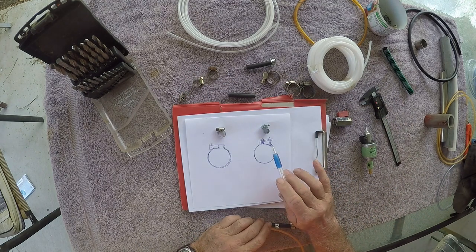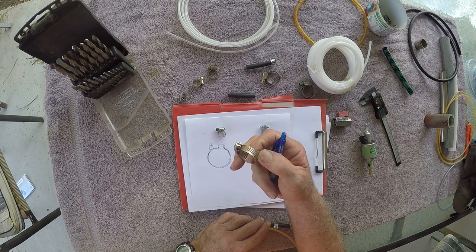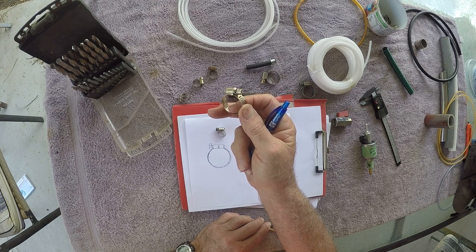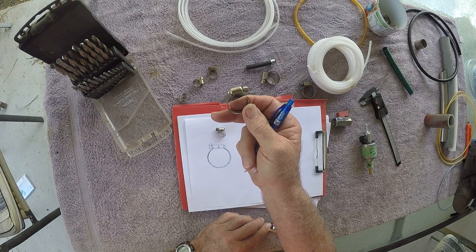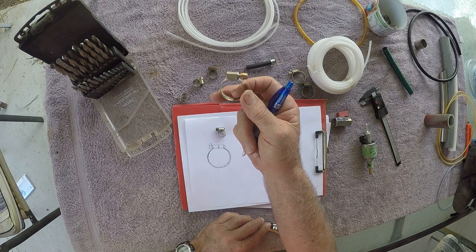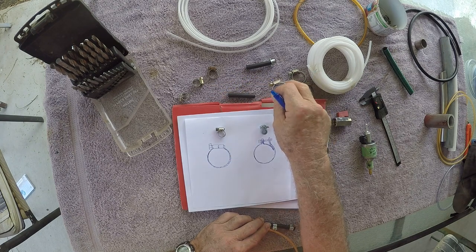For the rest of the installation — the stainless steel exhaust and everything else — just use all stainless steel hose clamps. It's worth going to a marine shop to buy fully stainless clamps. Some heaters do actually come with all stainless steel hose clamps, but most come with the pretend stainless — stainless band with mild steel worm drive and bolt.